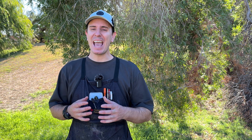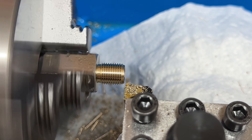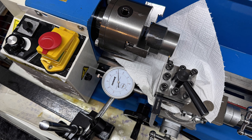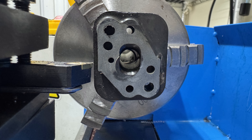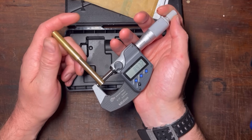As a small engine mechanic, anything and everything that I've wanted to make on this lathe I've been able to do — either because those parts are no longer available, they didn't necessarily fit my needs, or I simply needed a tool to complete the job. I've machined everything from custom piston rings from cast iron, non-return valves for fuel systems, intake manifolds, spacers, shims, nuts, bolts, seal install tools, punches, other hand tooling, and even my own part for a Stihl MS660 oil pump. Not only have I made these parts but I've been able to hold incredibly tight tolerances down to within a few microns.